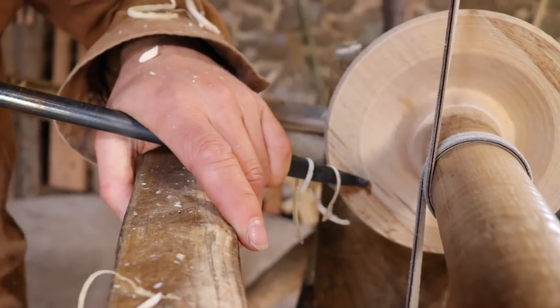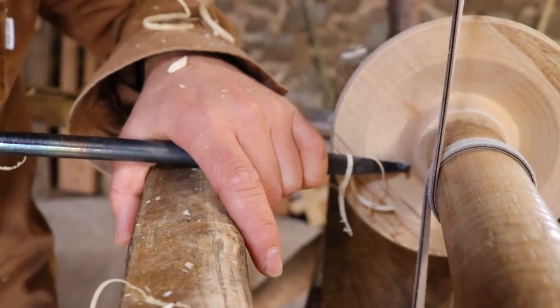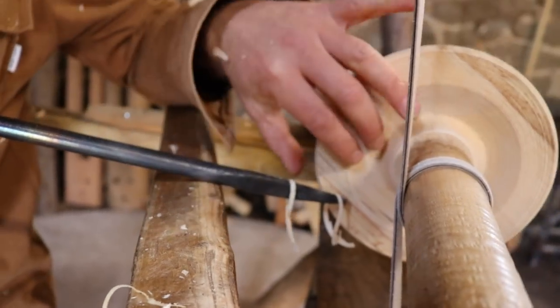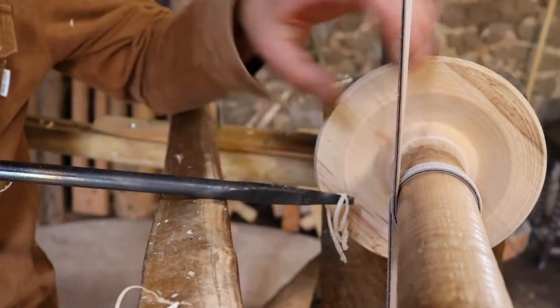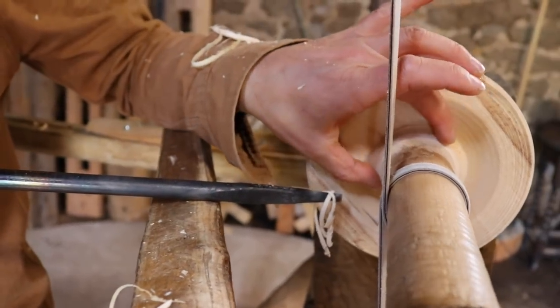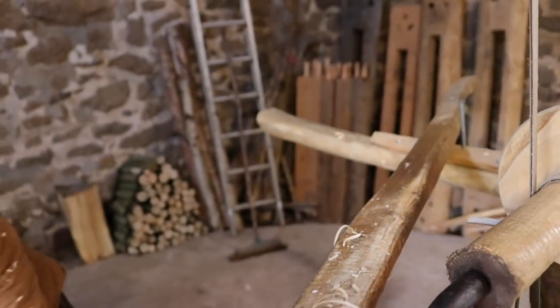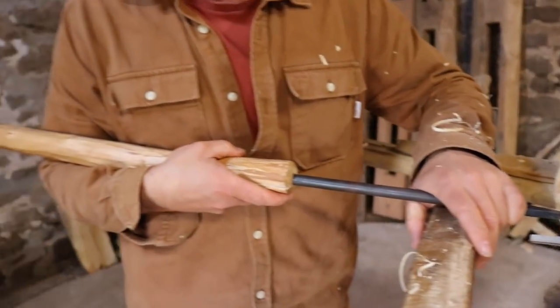So I can keep coming to the edge of this slope, working down to that point where it flares out around the mandrel, and I keep working back again and again until I start getting more hollowed, but stopping always before I reach the flare. But eventually I need to get rid of this flaring out. So I reach for the tip down tool again. And this is where I begin shaping what's going to become the core.